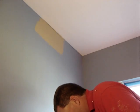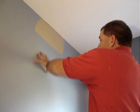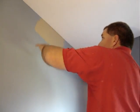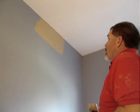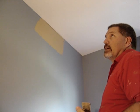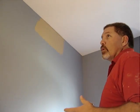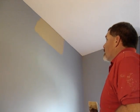Hat banding is a term where if you're doing a wall and you see where your roller section is different than your cut section, it's two different shades of the same color. That's called hat banding. And usually that's just because of the tint that goes into the paint. So if you roll over where you cut in, a lot of times you can eliminate the hat banding. That's typical more in some browns, golds, and then red is where you'll find the hat banding a lot.